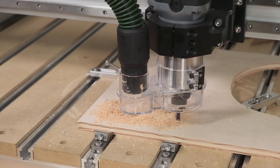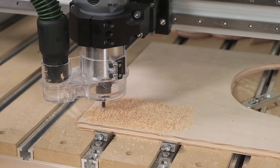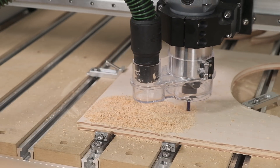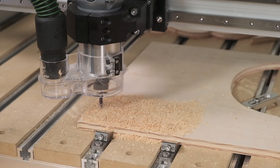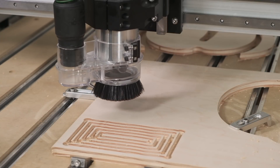Machining wood always sounds a little bit tricky and that's just the nature of the material and the tooling, but I'm not hearing a periodic thrum or resonance in the cut — i.e., no chatter. In softwood and MDF, this is totally fine. In a hardwood like oak, this is probably about where I would leave it. But with this plywood, I think we can push it further.